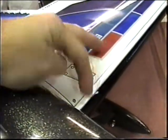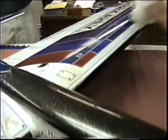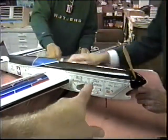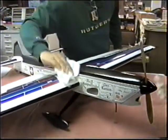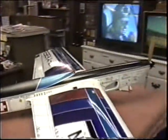Ran this until the oil is coming out nice and clean. This is virtually a new motor. You could wipe that off now. Right. That's the color castor oil should be. Clean it all up. Then what we want to do is take the fuel line off the motor, fill the tank up, or half fill it even, and then put caps on all the vents, and you're all set. Put that away for the winter, and you're ready, baby. That's all she wrote.